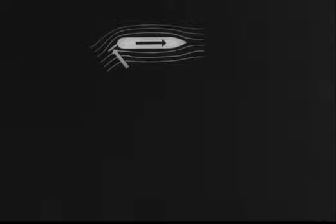The rudder of the boat relies for its steering effect on the forward motion of the craft itself. It is a deflector, working by the pressure exerted on its projected area as the craft moves through the water. Without movement of the craft, there can be no steering effect.